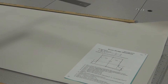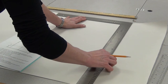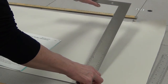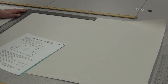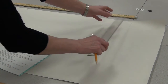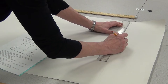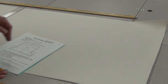For step two, use the L ruler. Put the narrow end up at the top, make sure it's parallel and even with the top edge of the paper, and draw that line about two thirds of the way down. Then flip it around, put it up to number two, keeping it parallel with the top edge, and draw it about two thirds of the way down. Now take a small plastic ruler and measure — that amount for step two is your rise. For me that's 22. Put zero at the very top by the one, mark where 22 is, and call that line four. Then go to the other side from two, put zero at the top, mark 22, and call it three. So two-to-three and one-to-four are exactly the same amount.